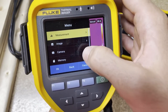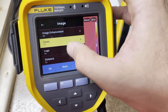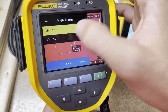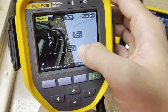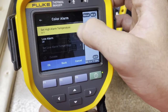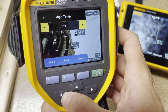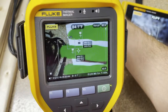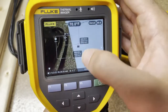The next thing to enhance our ability is look under Image for something called Alarm Color. We're going to turn the Alarm Color on for High, and we're going to set that threshold. Going back into Alarm Color, we need to set our alarm temperature. Right now it's at 86 — we want to make that 80 degrees, so let's set it to 81. Now when something comes into play, my hand shows green. But if it's an emergency we don't want green — green means go. We want red to scream at us.